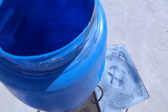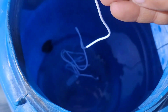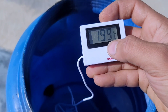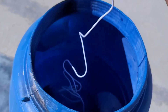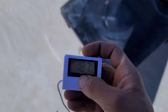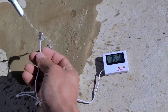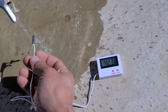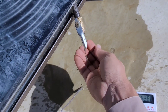The pipes, colored black, are heated through the sun, and water circulates through these black pipes, gets hot, and finally comes out of a tap which can be used anytime. We'll examine the temperature of the water before and after passing through the system. As you can see, the temperature of the water in the tank is 19 to 20 degrees Celsius. After passing through the system, the water is heated to almost 50 degrees Celsius. If you want to know how the system is designed, check the link in the description to watch the full video.